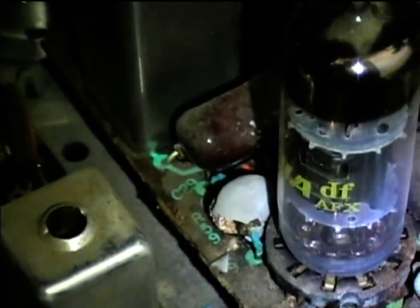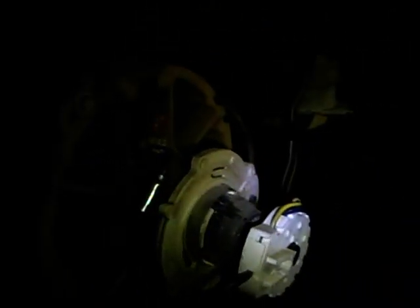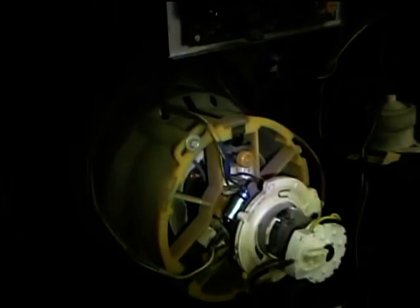This definitely doesn't look good, so I'm going to try and fix that. Now I'll demonstrate how we do purity setup on this. Just like when I was a little boy — I was about 13 or 14 with a CTC 31 — the clamp holding the yoke on was coming off, so I used a hose clamp. I remembered that trick and was able to put the hose clamp on there, caulking it out a little bit so it wouldn't short out any of the convergence coils, then gently tightened it up. Before putting it on I degaussed it to make sure it had no magnetism.